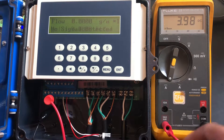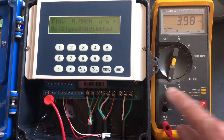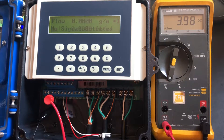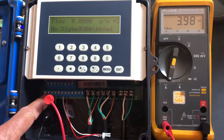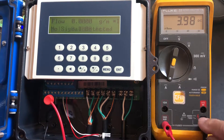The positive goes to the current side of a Fluke meter — so this is amps DC, current side, 300 milliamps. The minus side, which is the 4th terminal — this has AO minus on it — goes to the COM side.